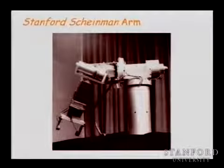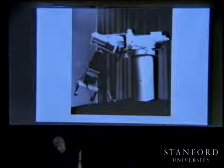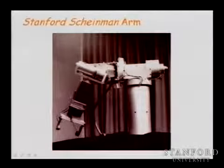This is a 6 degree of freedom robot. It's among the few robots in the world that has a prismatic joint. So the third joint on this robot is translating. When you pull here, you are moving along this axis, the axis of translation. So this is a prismatic joint. And it has this wrist that has 3 degrees of freedom, 3 intersecting axes. Actually, as you walk in and out, you can see a yellow arm in the museum exposition on the first floor, and you can see this arm over there.